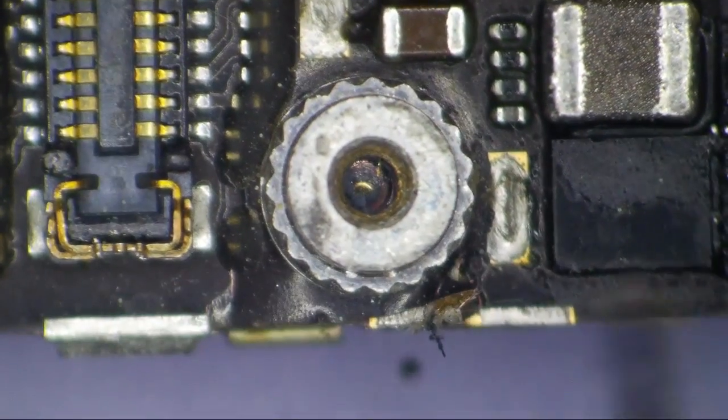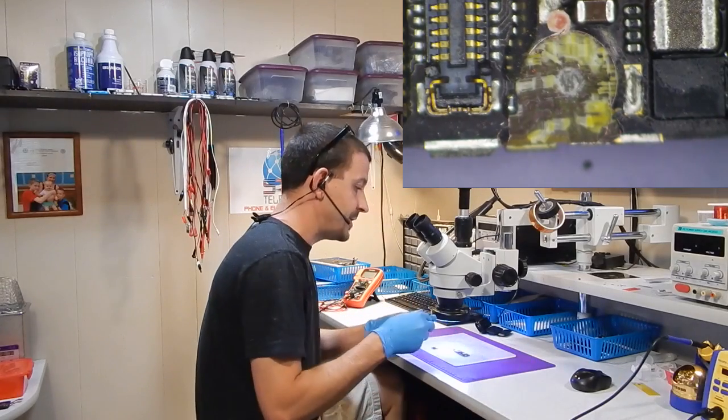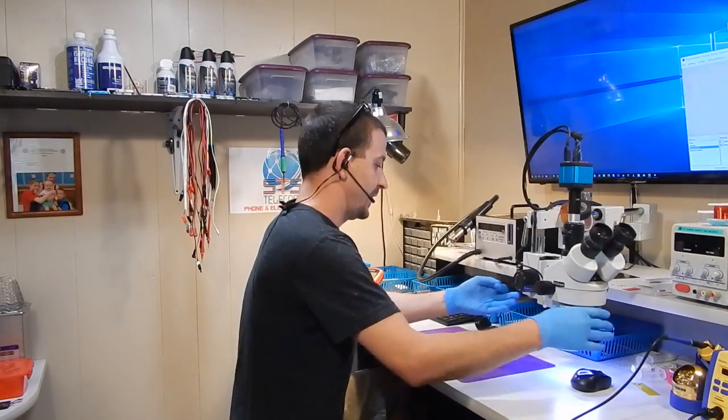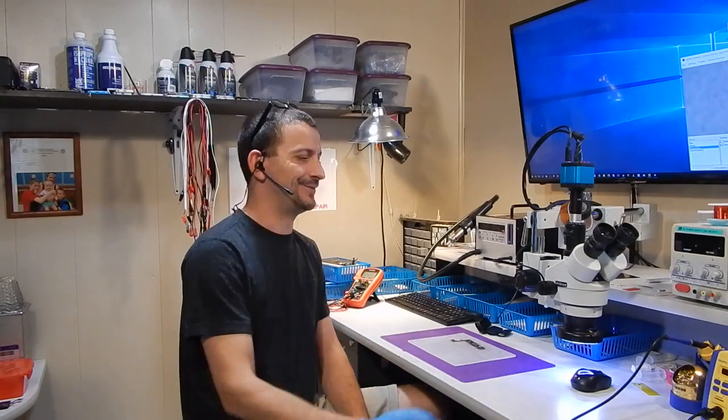It's a really big deal, and for science, let's tear up this board. So there you have it — sometimes these things will come in with the screw holes ripped all the way off. Since the board was pulled on so hard, you wind up with a lot of stuff pulled loose, and the damage isn't isolated just to the tip of the screw — traces from all over the place get pulled loose. There you have it: up close and in person, bottom left hole iPhone 6 long screw damage. Have a good day everybody, thanks for watching.